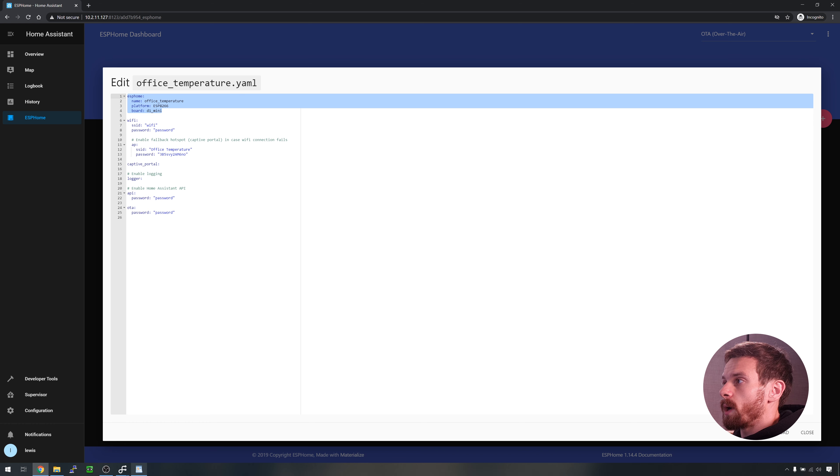ESPHome is now finished compiling and you can see it's now uploading to our device over USB. It gives you the progress of the flash below. Now we are directly connected to the console of our device, which outputs logs and makes it easy to troubleshoot. You can see it's scanning for WiFi networks and failing because I entered incorrect WiFi details. After a while it goes back to the fallback access point. So now we've uploaded an initial firmware to our Wemos — let's look at a practical example and show you just how easy it is to add a sensor to your device.